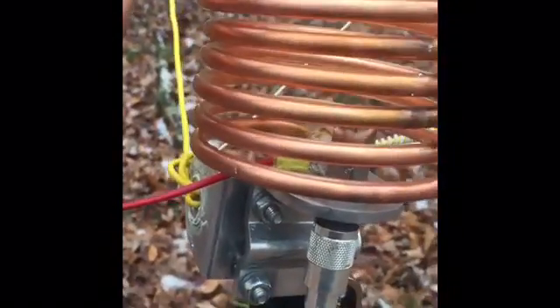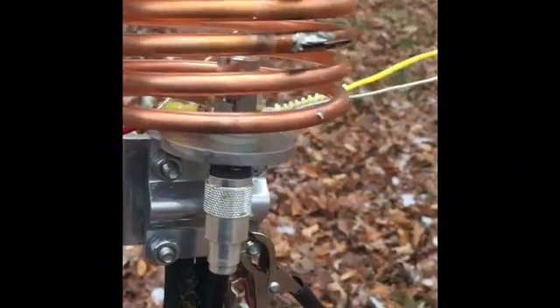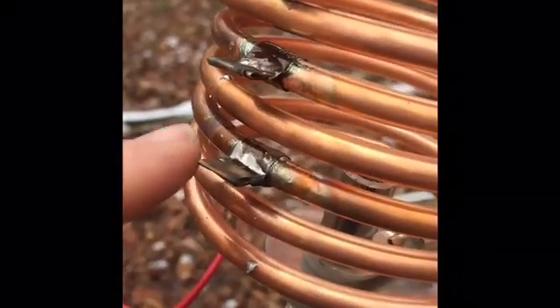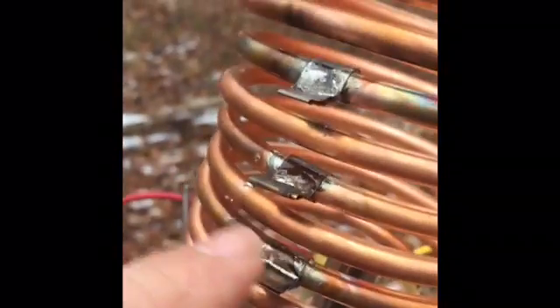It's not supported right now. I need to maybe get some popsicle sticks with some epoxy and epoxy it up, but right now I just wanted to test it, see if electrically it was close, which it seems to be. I made three clips here, three tap points — one, two, and three. Each of these are made out of copper, just some old copper weatherstripping that I cut down and then sweat-soldered onto the copper coil.